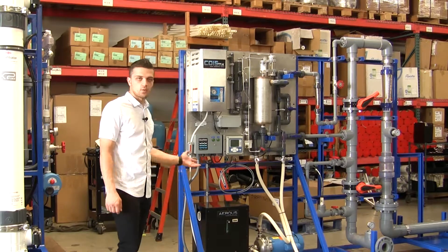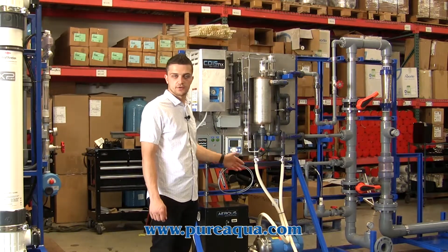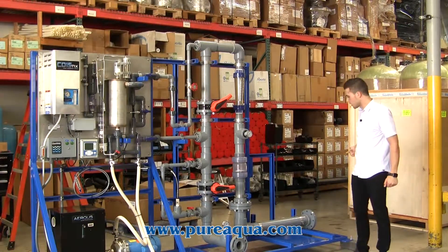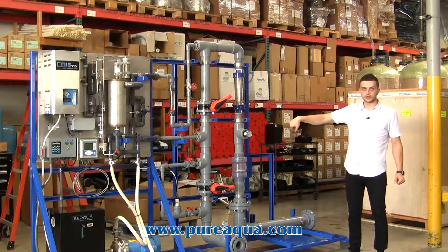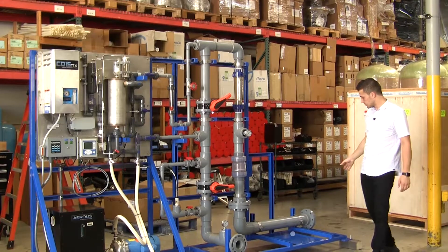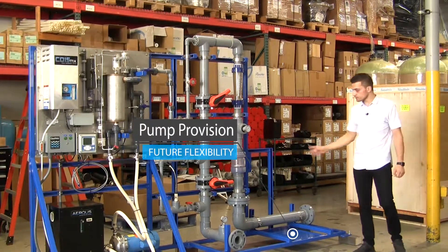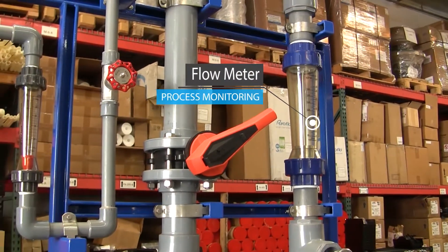Since the customer is doing water bottling, they requested mineralization and ozone injection for disinfection and bottling, to maintain a certain residual in the bottled water at all times. We're feeding 150 gallons a minute — we bypass part of the flow, inject it with ozone, then mix again. This is far more cost effective than passing the entire flow through the ozone system. The customer can add a future pump if they change their plant setup, so the skid is designed for future modification and expandability. It comes equipped with ozone sensors, flow meters, and gauges.